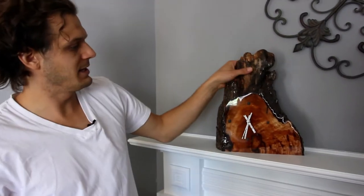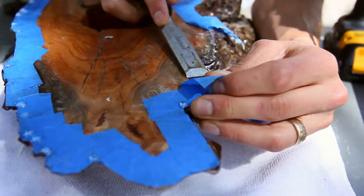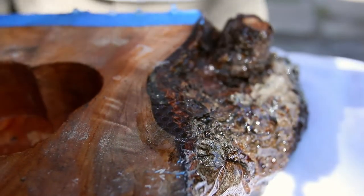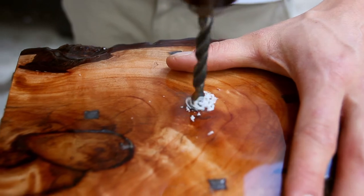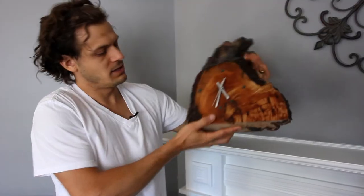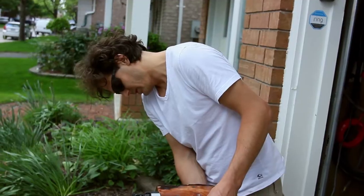So the last steps were really easy — just picking all the tape off of the back. Just use an X-Acto knife to get under there. And then re-drilled the center hole just to get rid of all the epoxy that had hardened in there, and made it nice and clean. And then just ran it through the table saw to make the perfectly flat bottom.